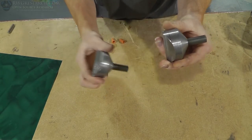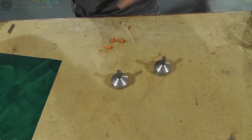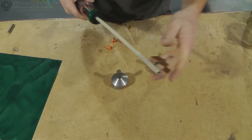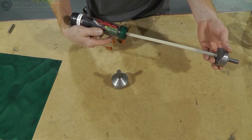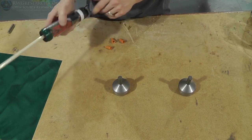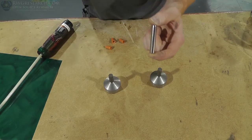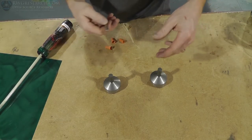I've got these with magnets on the back side — they do stick to each other but also fall off. According to the gaussmeter — thanks to my good buddy in Hawaii, Jack Schultz, who named this — we have a north field on this side and a south field on this side. The idea is to heat up the magnet, stick it inside here, and let it cool underneath that external magnetic field to see if we can create a stronger magnetic field. Currently I can only get a certain amount of gauss out of one of these magnetized sideways. So let's try it.